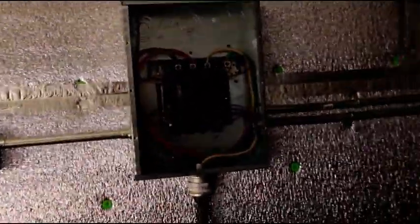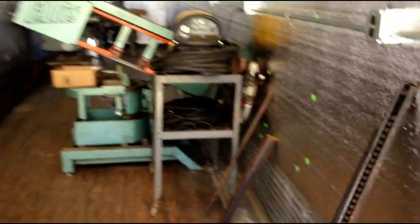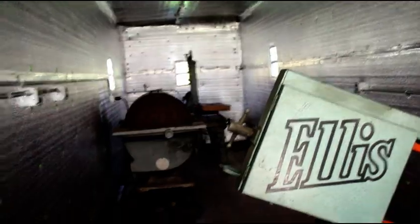I'm just finishing up the electrical in here. There's the panel. I have the saw running now, I have a plug for the plasma cutter, I have the big sander running, and the other band saw down the end is running. I've got outlets in here and some three-phase outlets for the welder. I just put my bulbs in today — just got the lights finished up. LEDs.